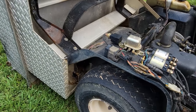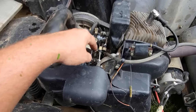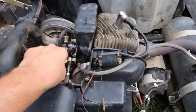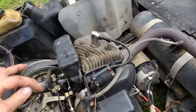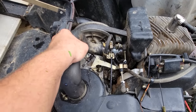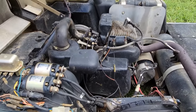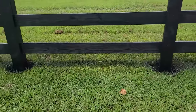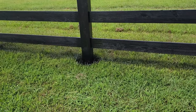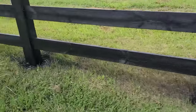Finally made it up to the shop, and then Diamond Rio, our beloved golf cart is down. It ran out of fuel and I think the diaphragm got dry — it wasn't pumping. So what I do is take the fuel inlet line off and give it a little backwards prime, and then I ran it and it was pumping fuel. So I plugged that back in, cleaned this out — had some moisture in it — and buttoned it all up. Now we got a runner. Yeah, this is looking a lot better. It's kind of a southern thing — in the Midwest and northeast it's a white fence, but down south it's a black fence like this. Not only does it protect the wood but it looks nice. Just a standard three-panel horse fence.